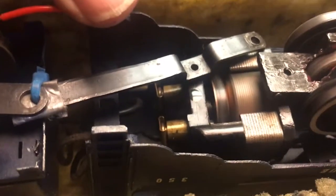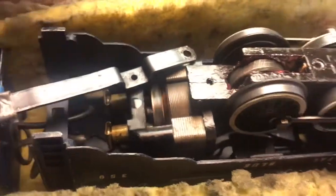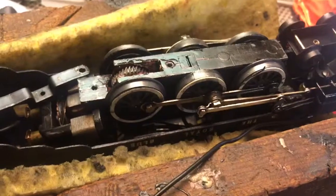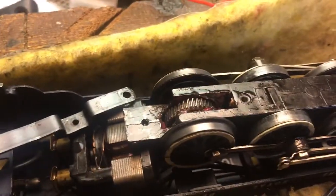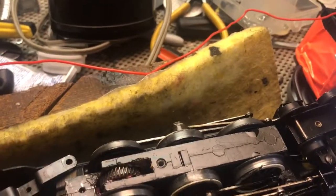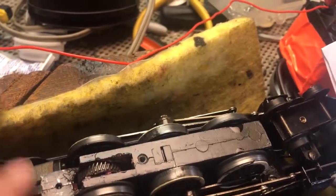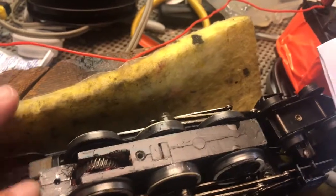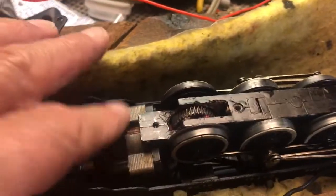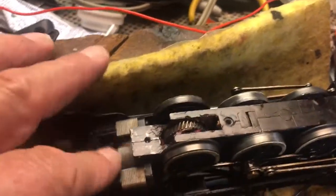As you can see, the armature is spinning. Make sure that the grease is good and isn't all hard in there. After you take off the pilot and screw, you can spin this by hand before applying power, and go all the way around to make sure there's no hard grease.